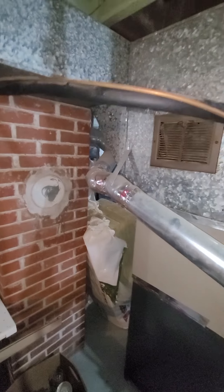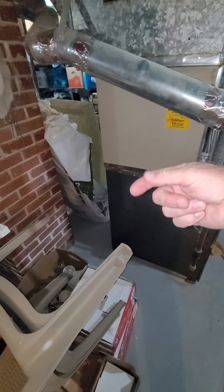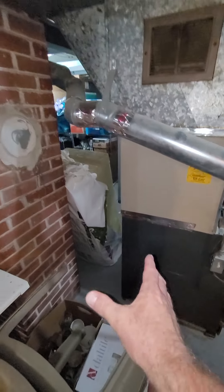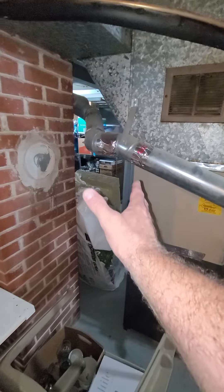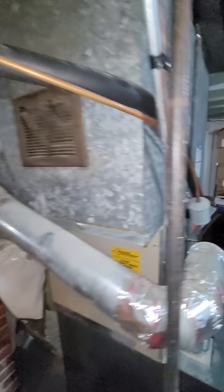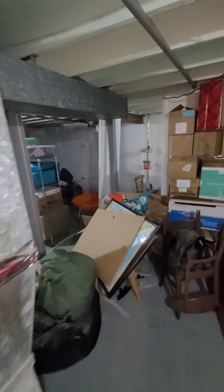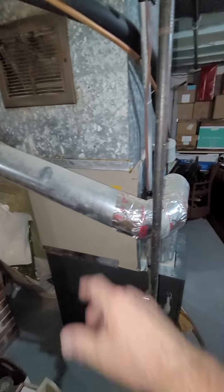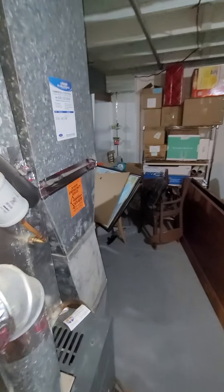What I'd like to do is, because this is kind of janky on this supply trunk here — if we can disassemble and turn this thing sideways and face it this direction, that way the supply is coming up. Move it over and put the supply right up underneath the supply trunk. It's eight by twelve, goes out both sides of the unit.